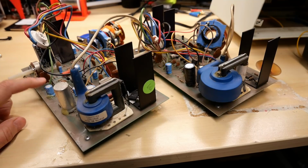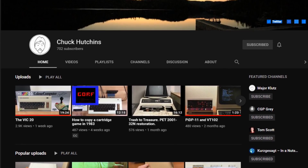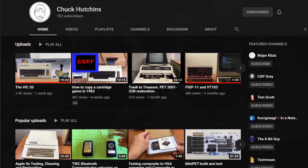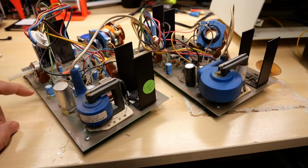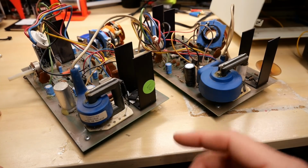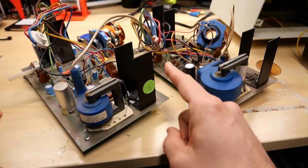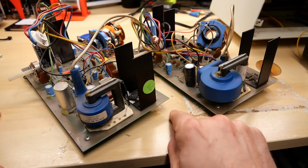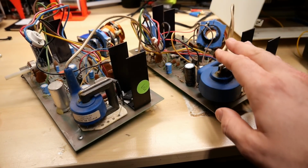I went ahead and asked some other people who have PETs, who also have the spot, to look at what value they have for their PETs. Now, Chuck Hutchins, who has a YouTube channel, I'll put a link to his channel down below, has two PETs, and both of his have the fast and bright dot, just like mine. And when he took a look at his capacitor, it was also 3.3 microfarad at 250 volts, just like my older board with the fast and hot dot. And then when Frank checked the capacitor on his board, which has the slow and delayed dot, he's got 47 microfarad at 50 volts as well, which matches Earl's PET.